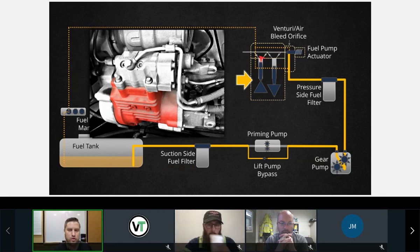and a wrench to remove the barrel plunger assemblies. That is not a procedure that is allowed by Cummins. If you guys are taking this pump apart, replace the entire pump. Do not put it back together. Do not put it back into service. Otherwise, you're going to have a vehicle that's on the side of the road. And we'll find out why in a little bit here. So yes, you're going to replace the entire pump.